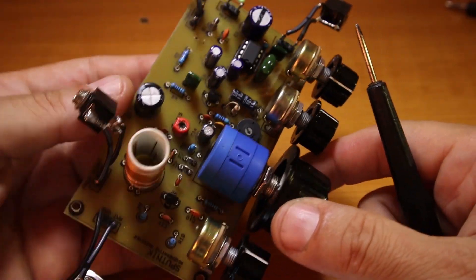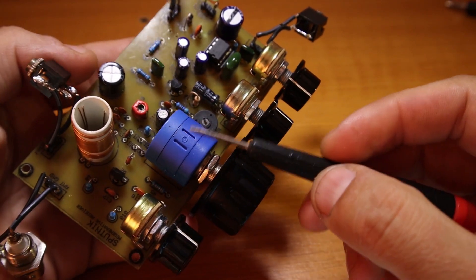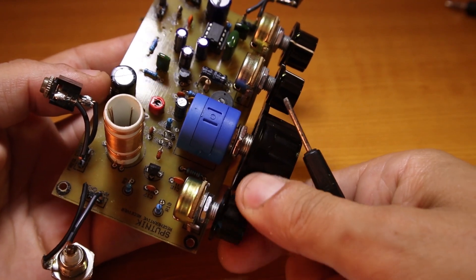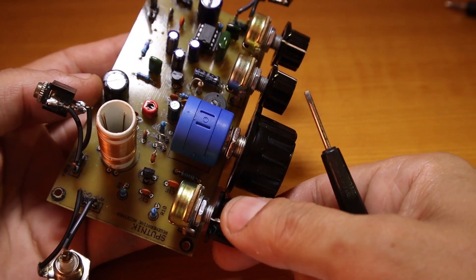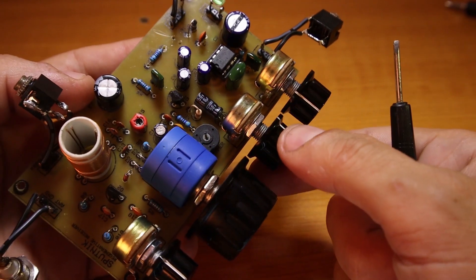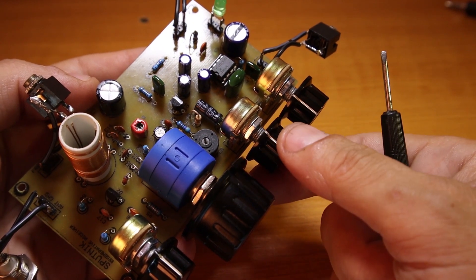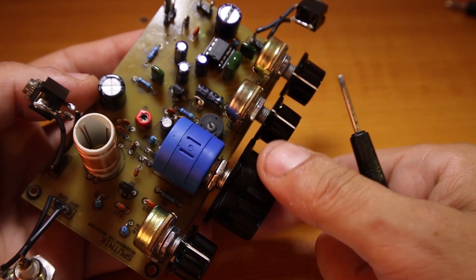These ones are not actually very good quality but they still work fine and the receiver is still stable. The way this circuit is built is very simple — every time you change the RF gain setting it will also change the frequency a little bit. The same is valid for the regeneration control, which you can actually use as fine tuning sometimes. And of course use multi-turn potentiometers for main tuning.